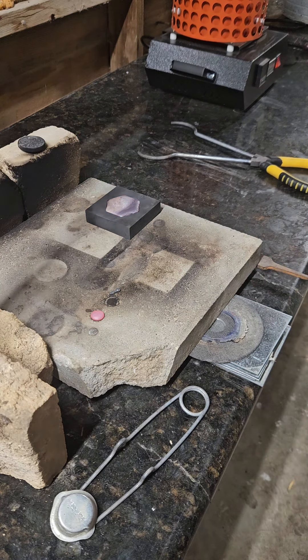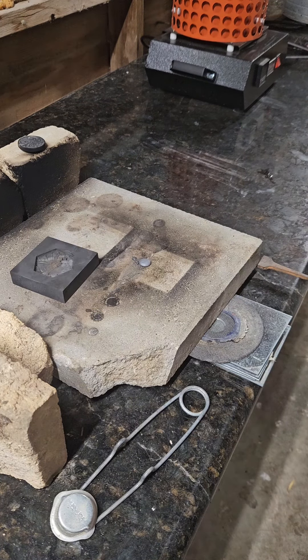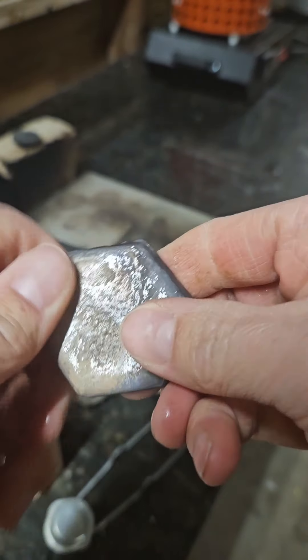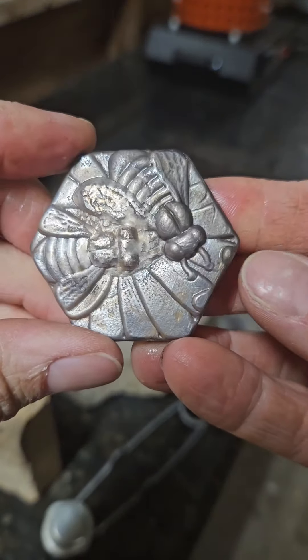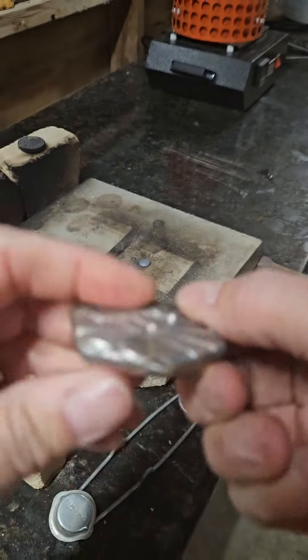Now it's downpouring rain out here. We have success, everybody! That is the trick — if you are pouring 925 sterling silver, you have to keep the torch on it. I wish I did that the first six times. Let's take this out and see how it looks. A win is a win. Could be better, could be worse. A little oxidization there from the map gas at the very end — I should have taken that sucker off immediately, but I'll take it. Ta-da! Honeybee round in 925 silver, guys — we did it!